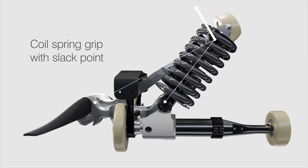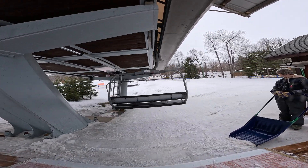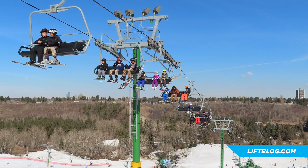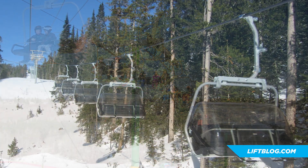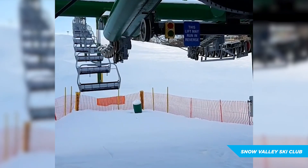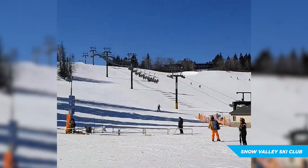What is a pulse lift? Most skiers and snowboarders know the difference between a high speed lift and a fixed grip lift. But a pulse lift is essentially a fixed grip chairlift made to be a high speed. This lift design works by grouping carriers — either chairs or gondolas — together into pulses, hence the name. This allows a large spacing between those pulses, which allows operators to increase the line speed during those gaps and then slow it back down for loading and unloading. This gives the lift a similar speed to a detachable, but with infrastructure that closely resembles a traditional fixed grip lift.